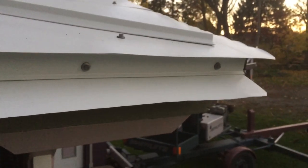Down here at the bottom I had a little drip edge to bring the water over to this corner — I didn't want it to fall down close to this corner, where we'd had some rotting out that I had to fix before. Hopefully that's going to bring a bunch of the water over to this corner. I also put a little good overhang on here, and then a little hood, so we've got double protection there. And then we put our scallops in to give it a little design.